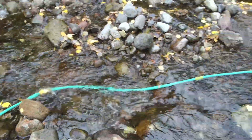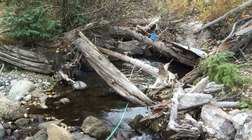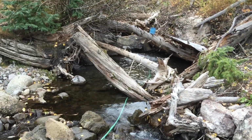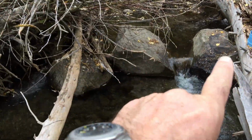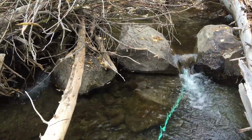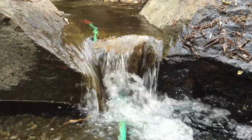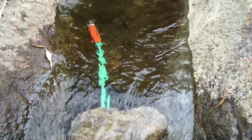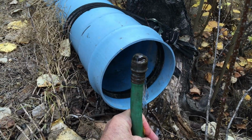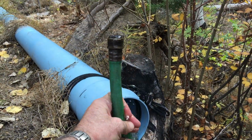With the water flow slowed, we took stock of the situation and discovered our intake point was essentially intact. There are two adjacent rocks that seem to be relatively permanent, and they create a very workable intake point with a pool just below them. So we undertook to measure the elevation difference the simple way with a full garden hose. Yes, we still had roughly 18 inches of fall over 87 feet.